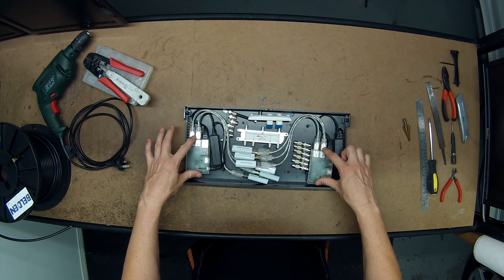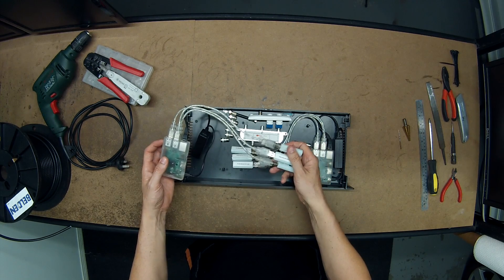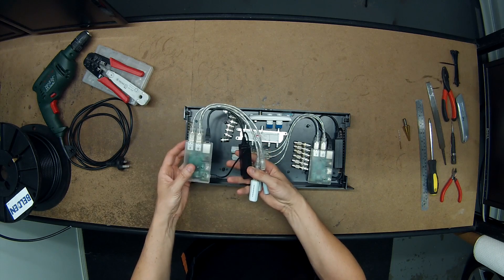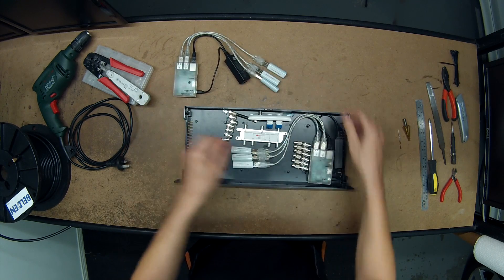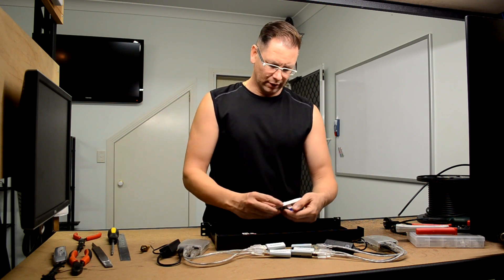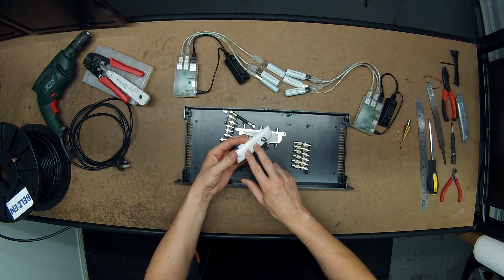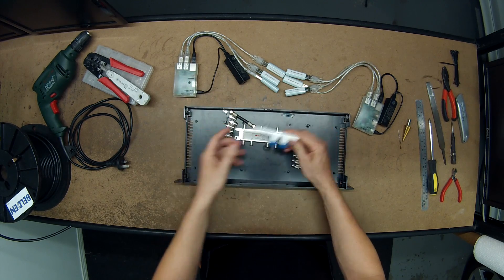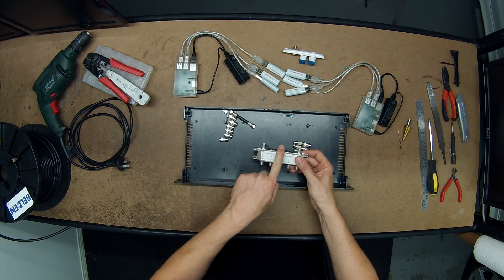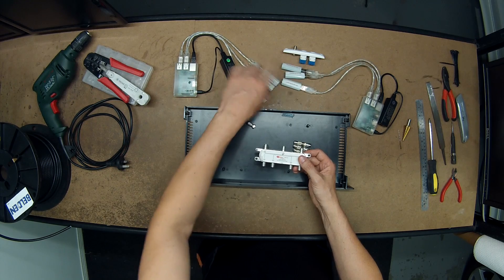It's going to be based on two Raspberry Pis, each one having three TV tuners, and it's going to be powered by a POE splitter. That way I don't have to worry too much about the power cables. So that's two of those. The connections at the back — I'm going to have an F-type antenna connection and two RJ45 sockets, one going to each splitter. The antennas are going to come into this six-way splitter and feed each of the TV tuners.